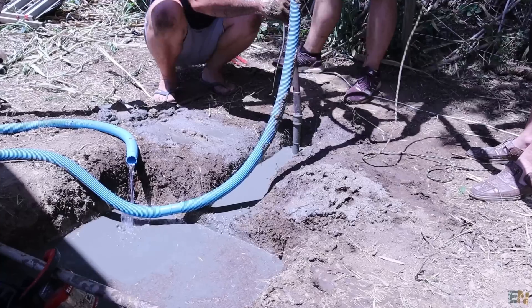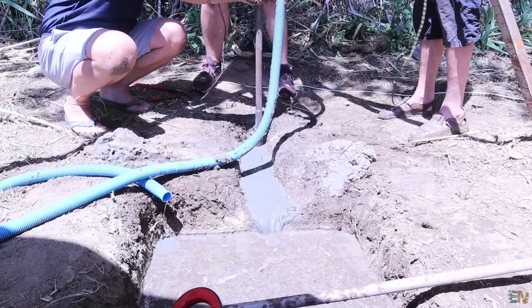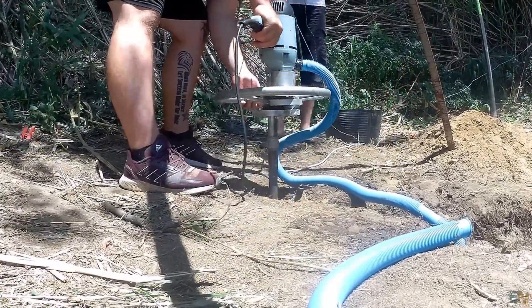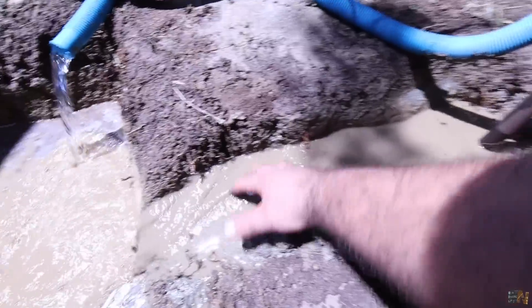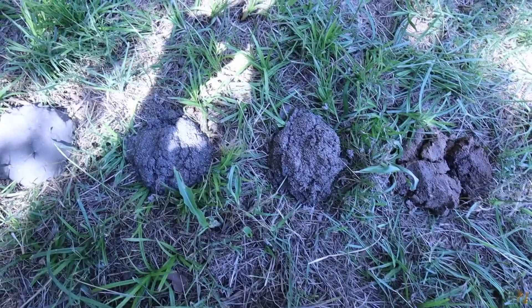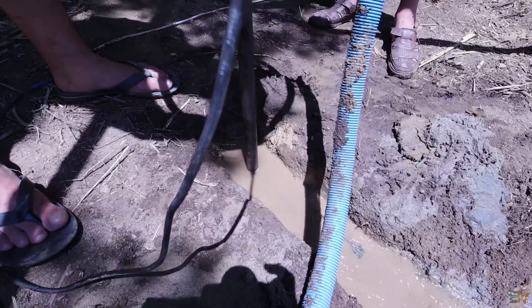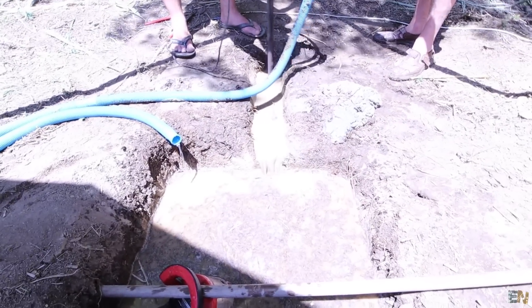I have 20 pipes but I'm not sure of the depth to my water. Without any special equipment you can't know for sure, so what you could do is ask your neighbors around, because the best water layer will be at roughly the same depth as theirs. Also, when drilling, keep some soil samples — the color and type of soil, whether it's more muddy or sandy, will give you information about whether you're hitting a good water layer. If the water level in the hole drops during drilling, add more water and more polymer, because the water has to stay thick.